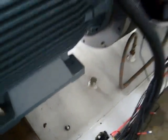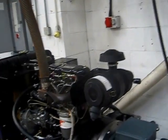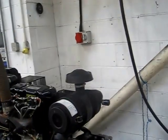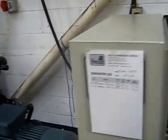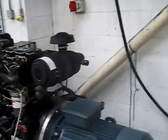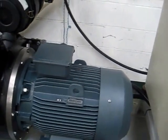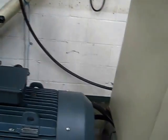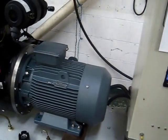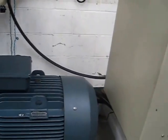The demonstration will start with me starting the engine and checking it's running at 1500 rpm. At that point, when it's driving the motor, I can connect the motor to the grid and no current will flow between the motor and the grid, because it's at synchronous speed. A motor only acts as a motor when it's slipping — in this case around 25 rpm below synchronous speed — and only acts as a generator when it's a few rpm up to 25 rpm above synchronous speed.